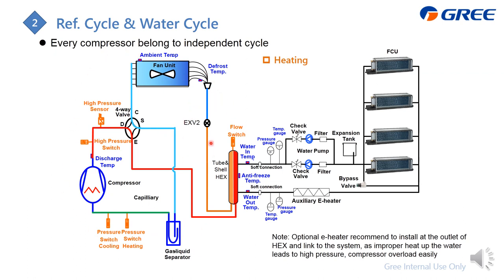For the inverter, if you recall from the last slide, we added the IPM module. In heating mode, the refrigerant gets expanded at EXV2 — EXV1 is for cooling, EXV2 is for heating. The purpose of the second EXV is to ensure the refrigerant passing through the IPM module is not too cold, because very cold refrigerant would cause condensation water which could damage the IPM module.